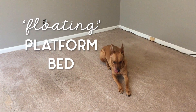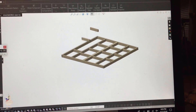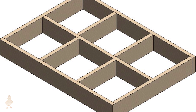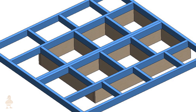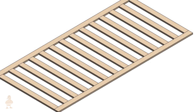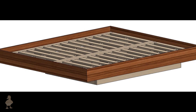I'll share all the details on how we put it together. Typically I create my projects and then make my build plans from what I learned, but for this one I decided the reverse was a better idea. There are three main sections to this build: the base, which consists of 2x8s; the middle platform, which consists of 2x4s and spans the width of the bed supporting the slats; and the bed slats, which support the mattress and are made of two halves that rest on the platform below. It was designed in sections to make it easier to disassemble and move.